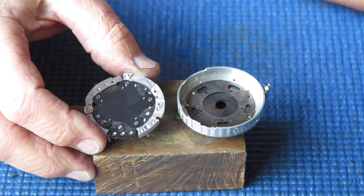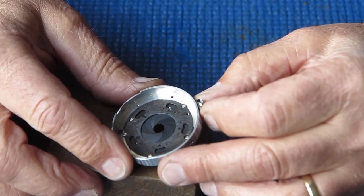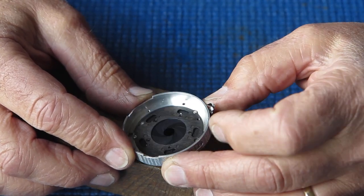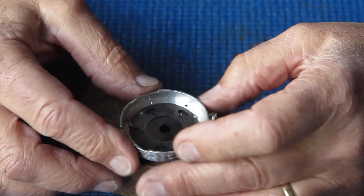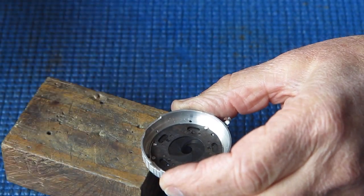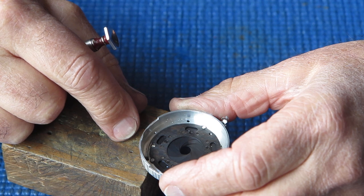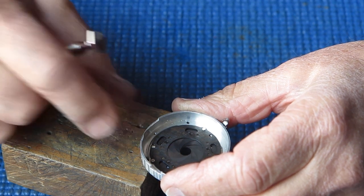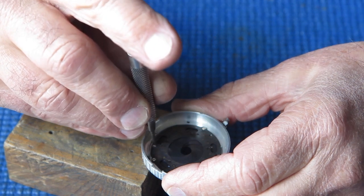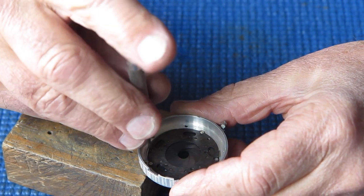The shutter case — here I'm looking at the diaphragm and looking at those blades. They're slightly distorted and they're oily. The lever doesn't want to move, and almost certainly that's because the blades are actually gummed up with oil. When you push on the lever you're effectively trying to force those blades to move — there's a large surface area of thin metal stuck together, and when you start pushing at one end it's not going to go anywhere, it's going to distort. I can look at these blades: they are not lying flat, they're curved up.